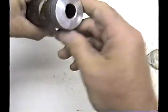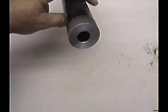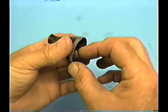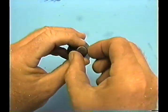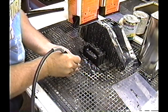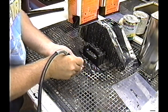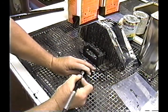Now I have to see if I can make a little part, or use one that I already have, from one of the molds I already have. Parts that I used and molded to make the baffles and the back ends of the custom pipes I make. So what I need to do here, roughen up where the joint is going to be, roughen it up inside, of course, and then get the hole diameter to what we want to use as the replacement hole diameter for this pipe. The idea again is to get it rough on the inside as well as the outside.